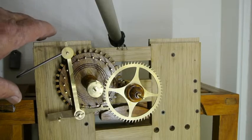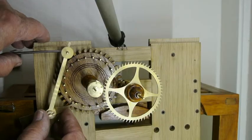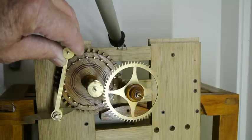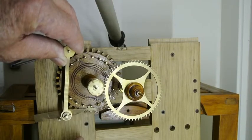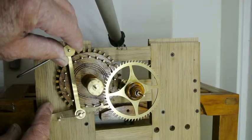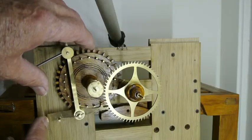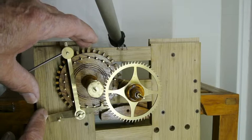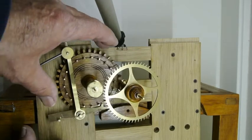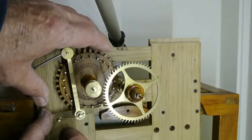And what you do is you move this lever up manually until you're in that position there, and then this pushes round until this comes off, and when it comes up to the end and it's sitting in the notch at the end here, then this misses the pins here so that the clock is free to rotate in the normal way.